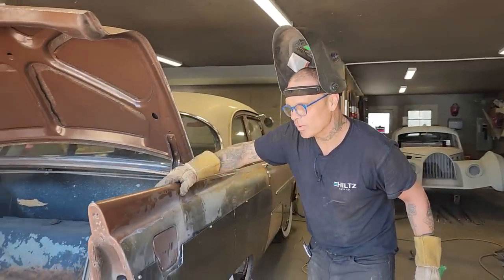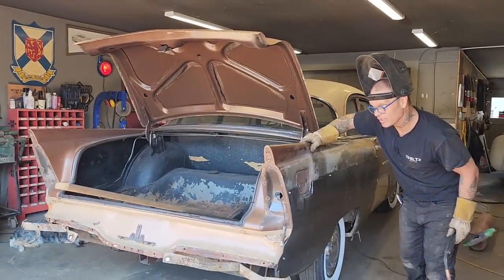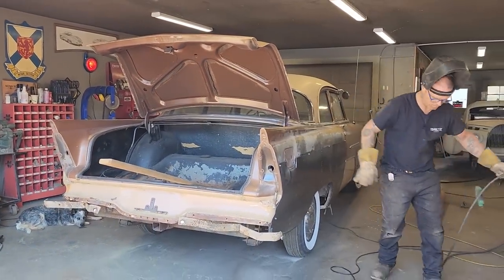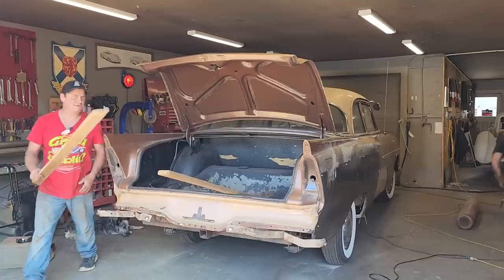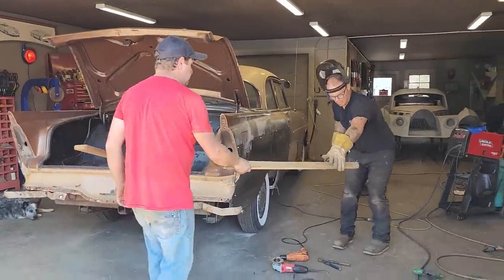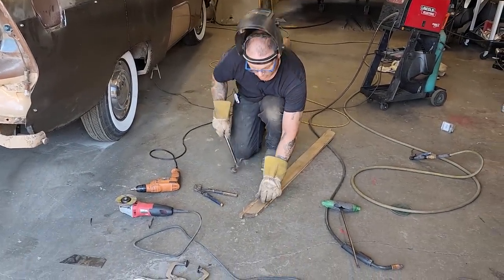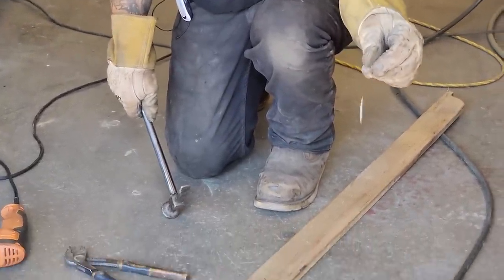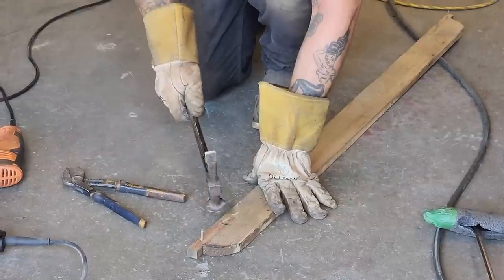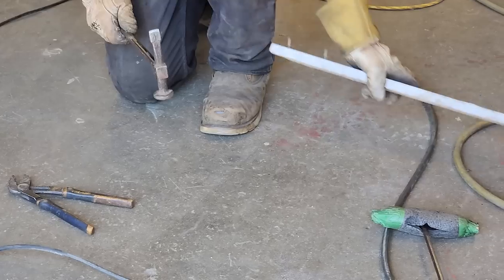Let's get a little smaller board, a skinnier board. Keep that board that you got. Maybe that little piece of, yeah. Got a nail on either end of it, don't it? Let me see it. This is why you do not use screws to build a house. That's right, that's it right there. See how that fell off, how that broke off? A nail would not do that. So you do not screw something together, because if it moves, it breaks off. That's why we do not use screws.